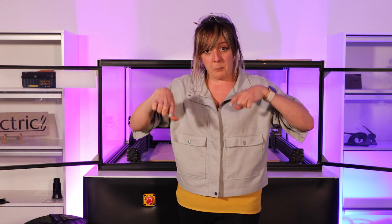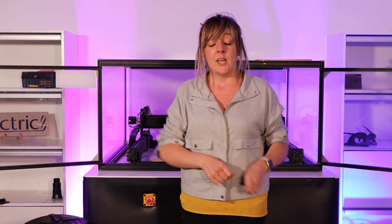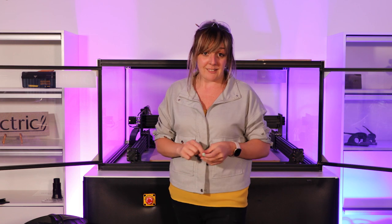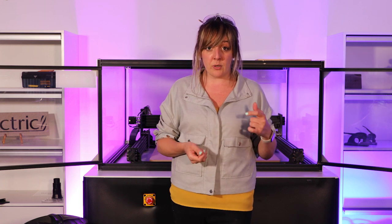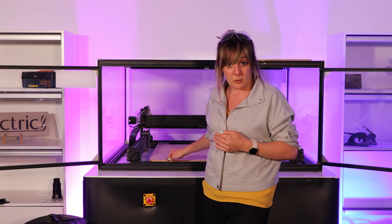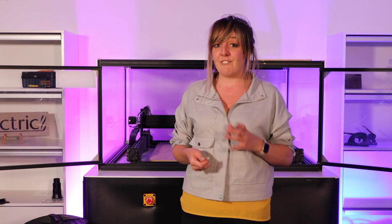So we're going to put these pins in those holes. We're going to locate our material. We're going to flip that over, put it in, and then we're going to secure it in with our screws to ensure that that board doesn't move. And then we're going to jump straight into the 3D roughing toolpath, and then after that we're going to change the tool, where we're going to set the Z0 for the ball nose tool off the spoil board, the machine bed. Remember, that's where we've got it set up in our file, so we must remember to do that on the actual machine. And we're going to run the 3D finish toolpath, and then everything should be done. So we'll see you on the other side.